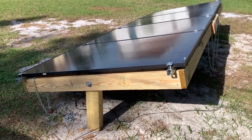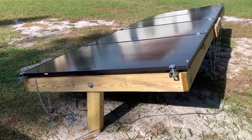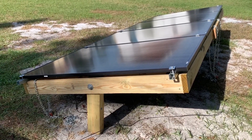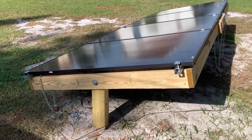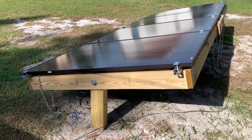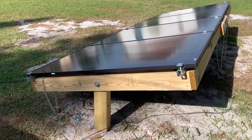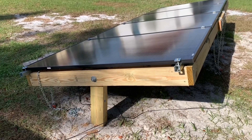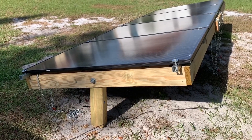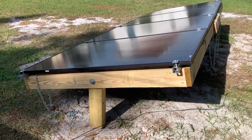Right now it's early April and we have these tilted at 14 degrees. When they were on the chairs they were tilted at 22 degrees, which worked pretty well. The first day I had this array I set it at 22 degrees, but when I checked the Solar Wrapp app for the ideal tilt at my location, I realized it was 14 degrees and adjusted it yesterday. Let me show you the device I use to figure out those angles.